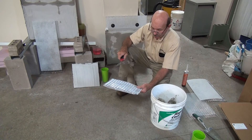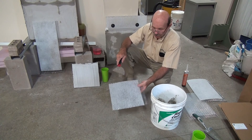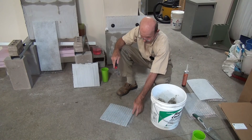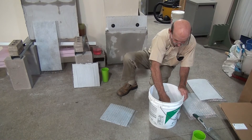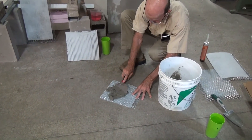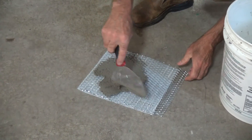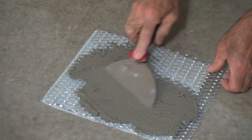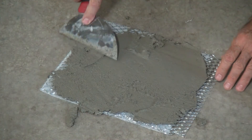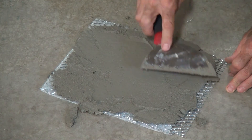As a sample piece to show how the mortar will enclose the lath during an application, we're going to take this sample piece of LathNet with the mesh on one side and the lath on the other, apply a cementitious coating, let it set up overnight, and then we'll peel it apart. This is pretty much how it's going to go on in the field — the difference being that the product will be vertical. In the application in the field, they'll probably use a heavier amount and put it on all at once, but that shouldn't make any difference for what we're trying to show here.